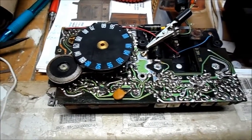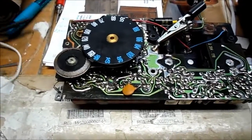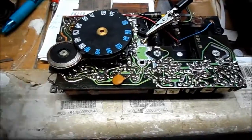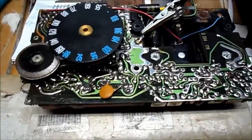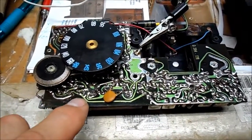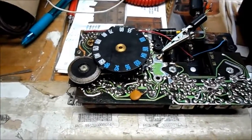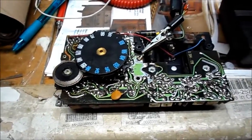There's another YouTuber that repaired a radio. He just biased the transistor with a resistor to ground, which I tried using a 10K just probing around. But other users said, well, the heat thing. Actually, on that YouTuber, as he soldered the connection for the transistor, the radio began to work. So I said, what the heck, I'll take the soldering iron. And the first transistor suspect that I hit, I got it.